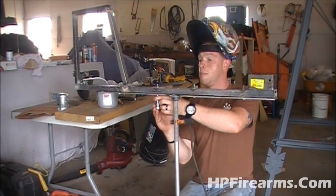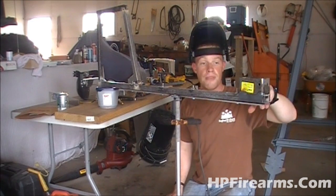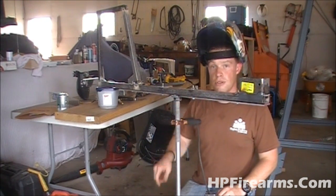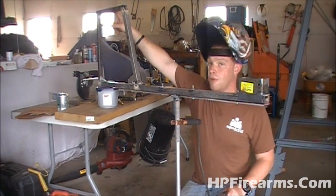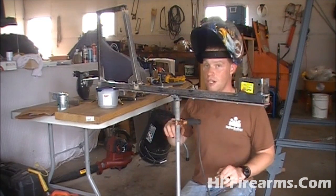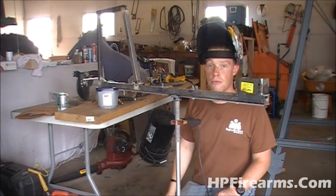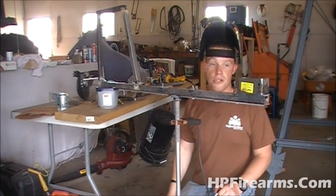This is experimental — I'm not a professional windmill builder — but I think this is going to work out just fine. On the front I took two pieces of channel and welded them to the frame, and tacked our motor mount on there, so that's ready to go. Holes are already drilled for the wiring from the motor, and there's a hole underneath to run down through the bottom. I also drilled a hole back here and up on top of our frame to run one set of wires from the motor down to the battery and then to the voltage regulator. Another wire will run in between these panels, and I'm going to mount a little 12-volt red light on top of the vane — that way you'll know there's power coming from the battery, meaning our generator is actually charging the battery, and it'll look cool at night.